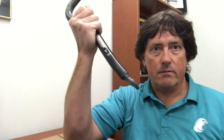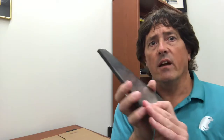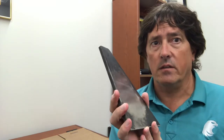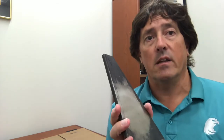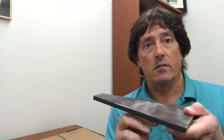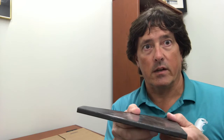This bar — yes, absolutely. This plate, however, is where we get into questions, because it's thinner than 15 millimeters, and ASTM A1038 says once we get thinner than 15 millimeters, we need to take caution. We should use a coupling method — like we do with Leeb — so that vibrations aren't trapped in the piece and you don't get sympathetic vibrations that affect your test result.